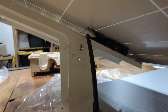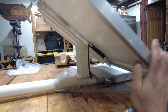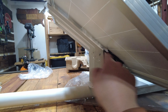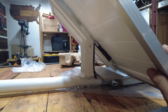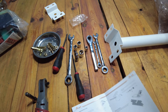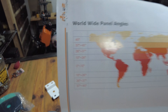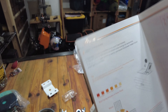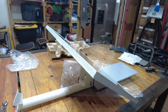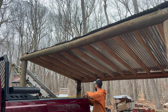Now we should be able to go outside and mount this up. The only thing left is mounting it to the actual shelter. You can see this pivots and there's room for two more screws depending on what angle you want. When I first assembled it, I had the solar panel flipped the other way so the longer side of the bracket was facing the light, which didn't allow the bracket to angle down to the lowest position. They actually give you a worldwide panel angle chart — for my zone it says about 26 to 37 degrees. I'm not sure which angle that is exactly, but we'll figure it out once we get outside.